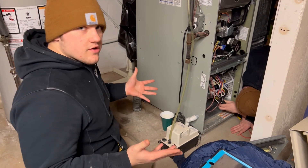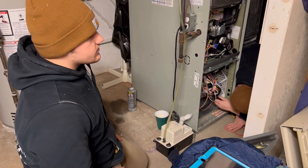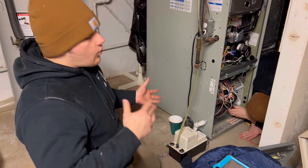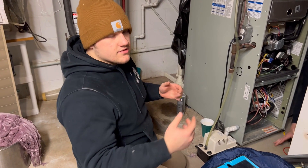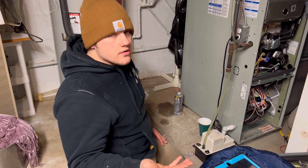It's kind of helping it get up out of the chair, so to speak. And it's important to keep those refreshed and up-to-date, because once they start to get weak and that motor starts to lose that help from the capacitor, windings and bearings start to go out. It starts to pull higher amps than it should be, runs hotter than it should be, and it can make that motor fail much quicker than it typically would.